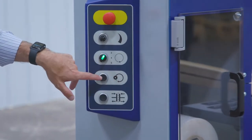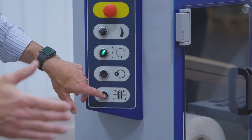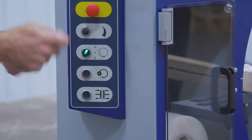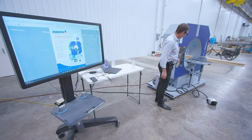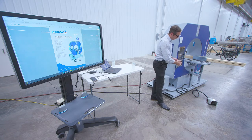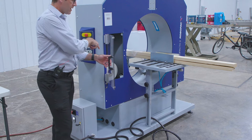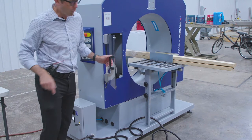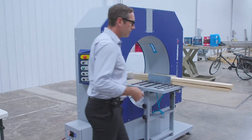This icon will home the film carriage if it has some kind of break somewhere. The last item here actuates the autofilm cutoff — you thread it, hit it again, and it'll pull it back. Five or ten inch film is optional in these units — what's called flush core. If the cardboard or corrugate is sticking out, that's an exposed core, so you want flush core. There's an interlock on this, so once you close that door, you need to tap it to turn the machine back on.